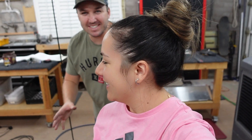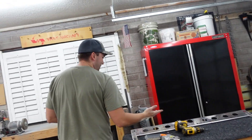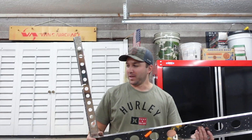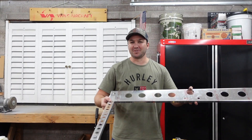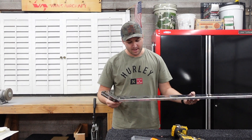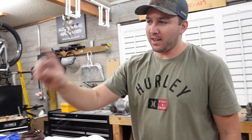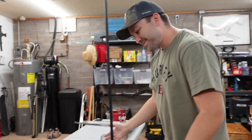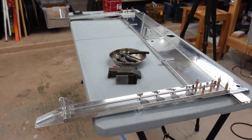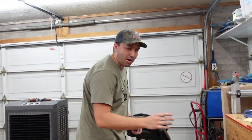All right, we're done. Chapter 25 was a success. You'll see behind me I just wrapped up the very rearmost bulkhead. This one was super straightforward — it was a total of 24 rivets, very straightforward. The other bulkhead, all these were very straightforward. The only really hard parts for riveting were these blocks here — you're probably not going to be able to see on camera, I'll post a close-up clip on screen. These blocks that are behind here — you'll see this one is already riveted on.